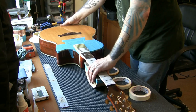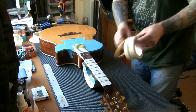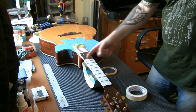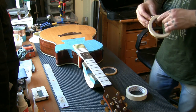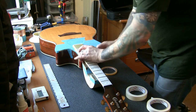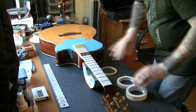I'm just about to wrap up for the day but before I do, I'm prepping the guitar neck for fret leveling and crowning. I put strips of masking tape down both sides of the neck. I have three different widths of masking tape, and we're going to tape between the frets. That way when we level we don't get any damage to the wood. It's also easier to clean, and when we come to crowning and polishing we won't cut into the wood.